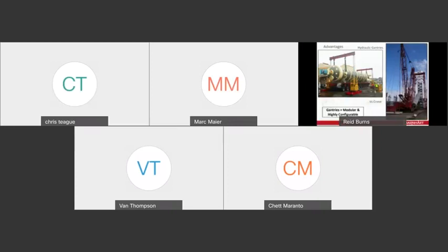And so like I mentioned, a big advantage to hydraulic gantry arrangements is their ability to be customized specifically for a particular site. As I mentioned, they're a modular system and they can be tailored to overcome some pretty specific site challenges. So let's say you've got a void in your supporting surface. Well, a gantry track can span over that. If you've got overhead power lines nearby where you're wanting to make a lift, the gantries can be rigged really tight to the piece, and they can sneak beneath the lines all the while maintaining OSHA-approved clearances.